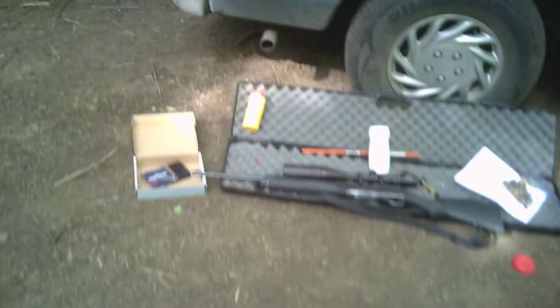I really have to push the trigger. So, there's nothing notched about it. There's no flats. There's no nothing. And then as far as what retains these little lugs, that's just a 1/8 inch roll pin. I drove it through, and then I kind of bent it backwards a little bit. Tap, tap, tap. And there we are.